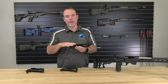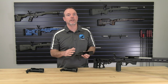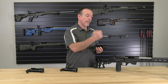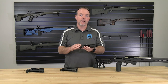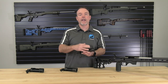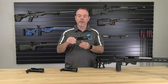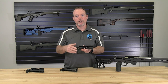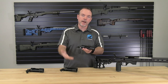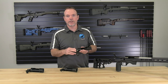The top steel strap also adds a lot of rigidity to the actual receiver itself — think about flexing and moving. When you're hanging extremely heavy barrels — for example, a 0.9 muzzle or bigger 26-inch Krieger barrel with a suppressor — that's a lot of weight pulling and flexing on the receiver. Having a machined-in rail helps deal with that and adds rigidity. The flats machined into it rather than a traditional round profile also add a little bit more material, stiffening up the action ever so slightly.